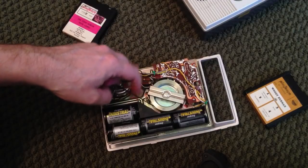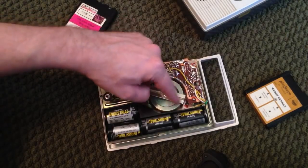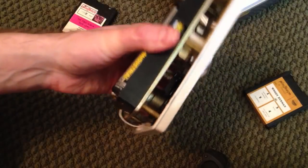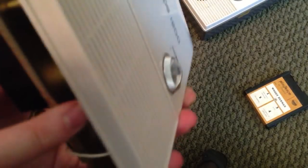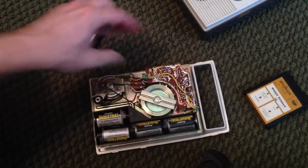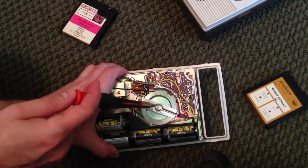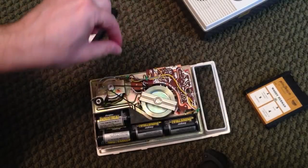The belt in the one I had was working — a fairly decent belt — but it still had a little slack in it. Pulling on the belt should pull the motor and wheel together, but the other one would slip a little. Also, the speaker in this one was completely shot, so I took a speaker out of something — probably a clock radio — and replaced it, as the original just vibrated with noise. To replace the belt, there are a couple of screws to remove: one on each side of the flywheel bracket. Once that bracket comes off, you can replace the belt.